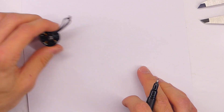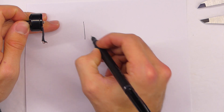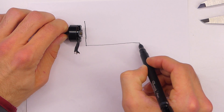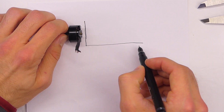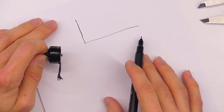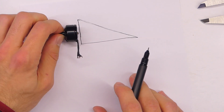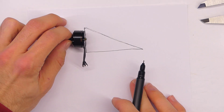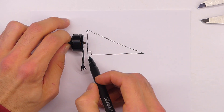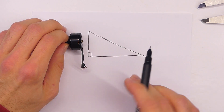So let's draw a view of what I'm imagining. From a side view, we're basically going to have like a triangle. We'll have this part where the motor goes, and then we'll have this flat bottom part — this is the part that we will actually glue to the aircraft. And then we need supports so that this thing doesn't just snap in half. We'll create basically a triangle going from there. So we're going to have a 90 degree section right here from the front of the mount and the base of the mount, and then this angle that's going to be sort of the support angle.